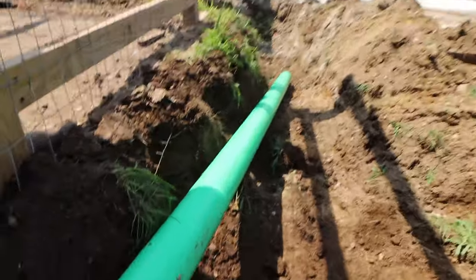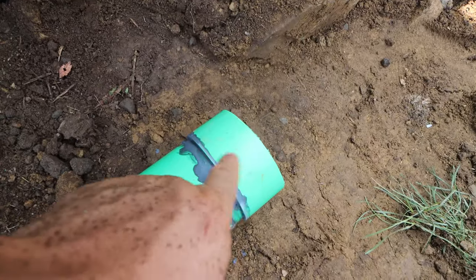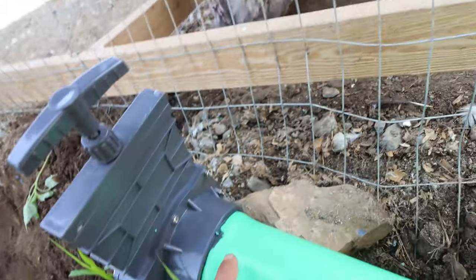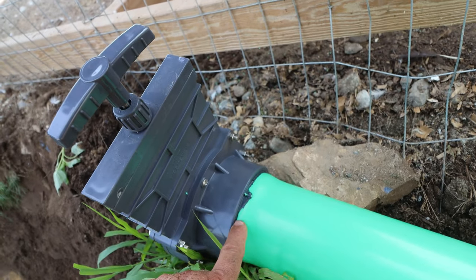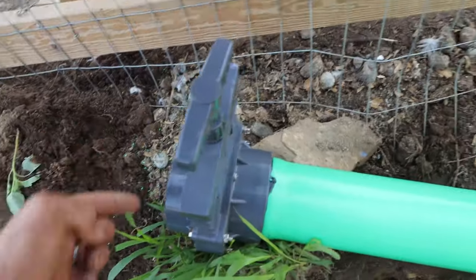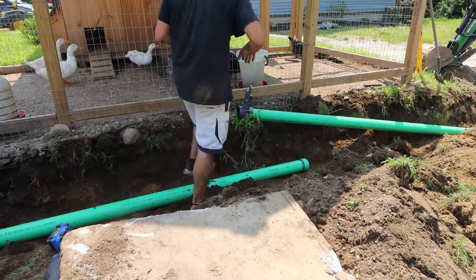But here at this end, we had to custom make an adapter to make it fit. So this is gluing now. That'll now fit into this end, which is the pipe is tapered. It's bigger here and skinnier here. So we cut a little of the taper off and put it on this side so we can get the taper on both sides of the valve.